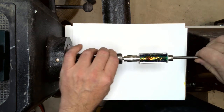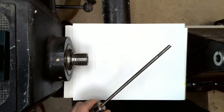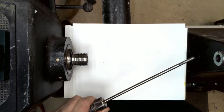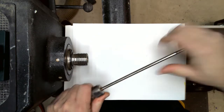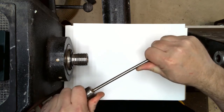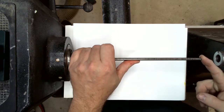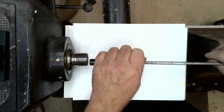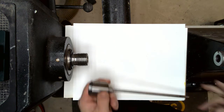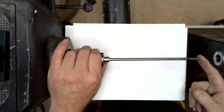The challenge with this setup is simply pressure. Because I'm putting pressure all the way over on the end using a 60-degree point live center, it's point pressure — just a single little point taking all the pressure of my tailstock. It's not that hard to bend the mandrel. So if I put any pressure on here and it bends, I'm going to get an elliptical motion that causes out of center. Manufacturers started doing a whole bunch of different things to address this — one option screws onto your headstock, but we still have the same problem on the other side.